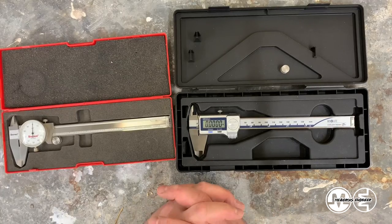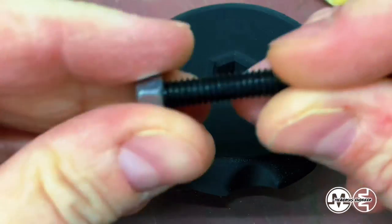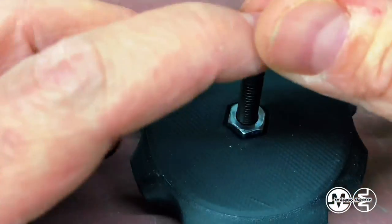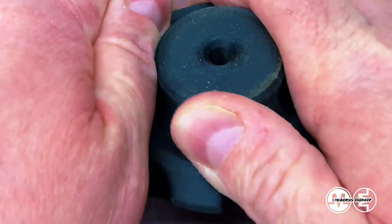I would say that if you're going to look for a set of calipers, decide on your purpose first. Are you doing woodworking? Are you doing metalworking? Are you machining? Are you 3D printing? For some 3D printing, I would argue you need the most precise calipers you can get, and you would probably want something that would last. If you want to do press fits at all in anything, any material whatsoever, you definitely need to have an accuracy within a thousandth, because you need that sizing to appropriately make parts mate with each other and make them stay when you press fit them in.